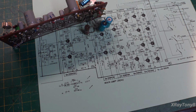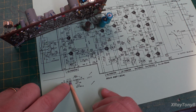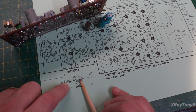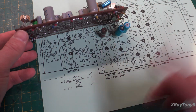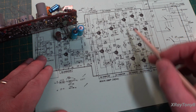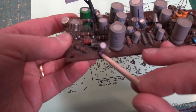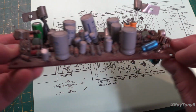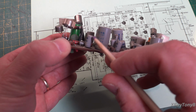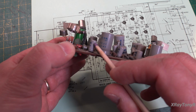So after looking at things a little bit more, this is making a lot more sense. Down here you see this little network. So we have our little thermistor, we have our diode network, and we have our pot. And they're calling that TH1 and TH2. So you can see TH1 and TH2 over here, and they connect on TH2 and TH1 right here and here. Now these capacitors, and I'll show you why I say this in a minute, these are stability capacitors, and I believe they do belong in there, and this was a modification done at the factory before this thing shipped.